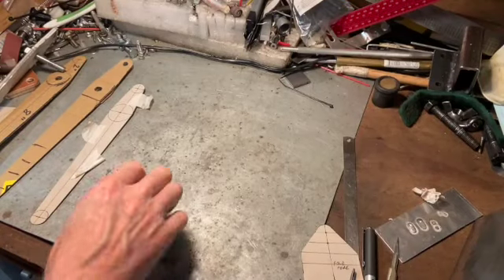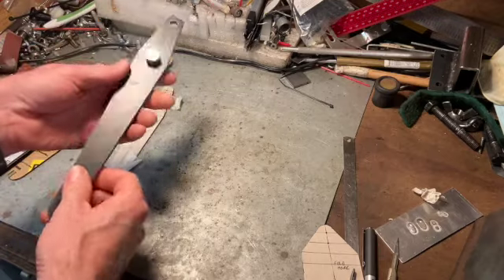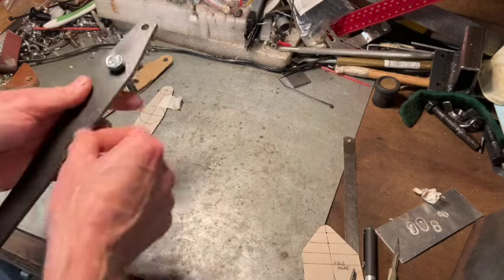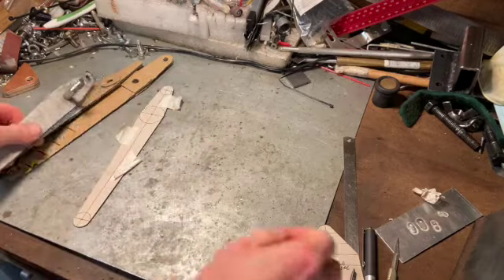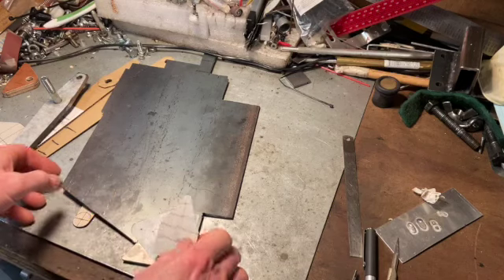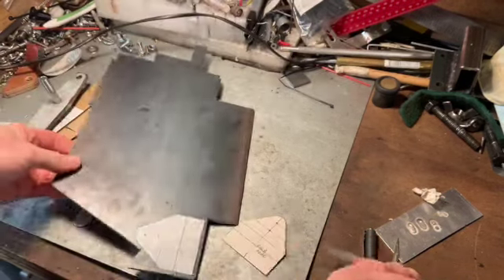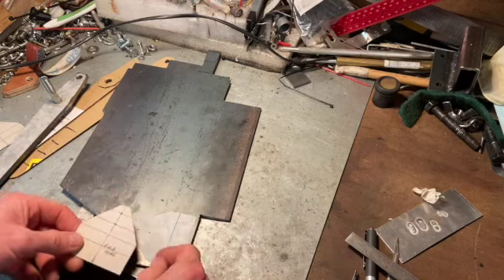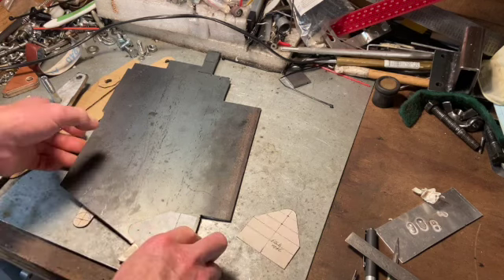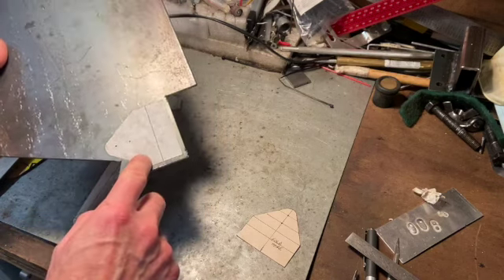Now at the bench — these are the prototypes and this is the pattern I've settled on. I've cut this out of six millimetre steel. It's a solid thing, it might end up being the final design. I've just cut out the shape, taken the sharp edges off, and drilled a couple of holes. The next thing is to make the brackets. I made this little template and marked it up on four millimetre steel, which will make some quite chunky brackets. It needs to have a fold, and it's very difficult to fold four millimetre steel, so I'm going to do a sort of half-cut, half-weld type fold.